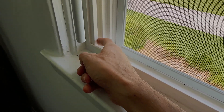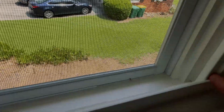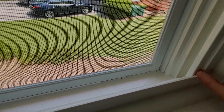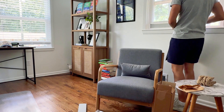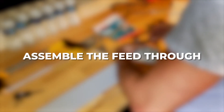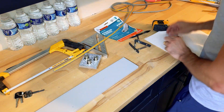This is a very critical step because if you measure wrong and you cut the window wings too short, you might end up needing to improvise to fill the gaps later or even purchase new wings, although it's not the end of the world. With the correct spot selected, measure the width using a tape measure. Now that you have your measurement, you need to assemble the unit before you can cut it to the correct width.